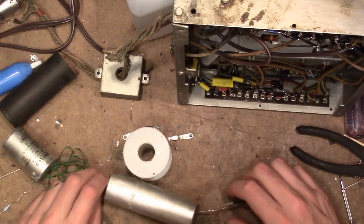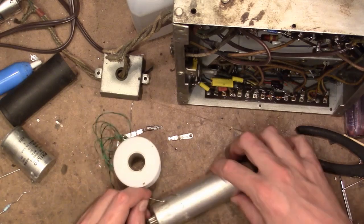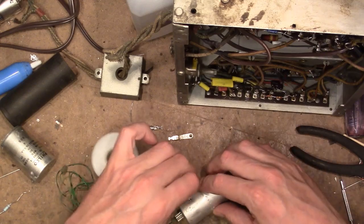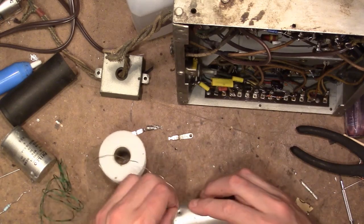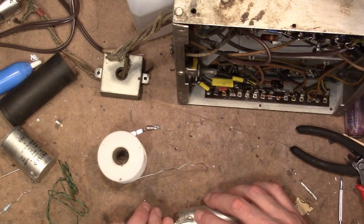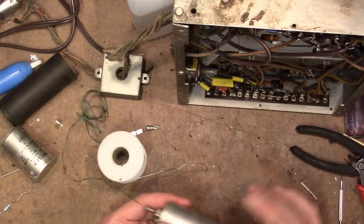The other reason I'm doing this is to practice techniques for when I do more valuable radios like my 37690, which I intend to stuff all the caps on. And there we go — anode and cathode. I'm just going to trim this off a bit. Nice good solder blob. Down the right way. Trim that off flush and sand it down a little. I can secure that with a bit of glue. One rebuilt cap.